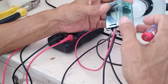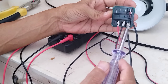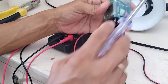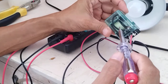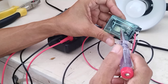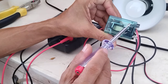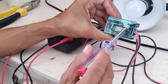I'm just going to do this to simulate the operation. This is a 24 volts DC relay — I already have here the negative and positive for my 24 volts DC. I have a transformer which can produce 24 volts DC. This round thing here is the coil, and that round thing is the one that will magnetize the contact. We have there the normally closed contact and this one is normally open — the contact changes between normally open and normally closed.